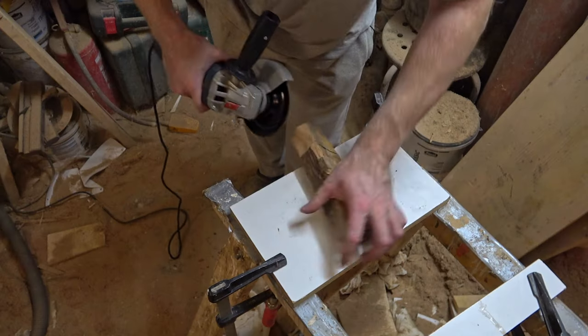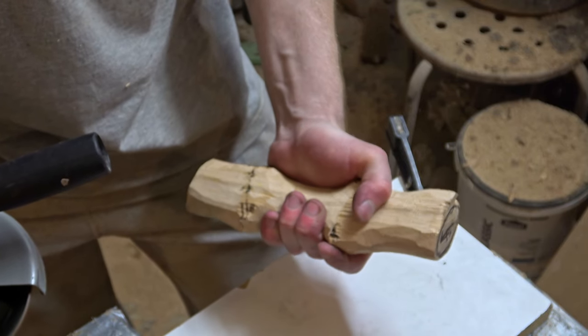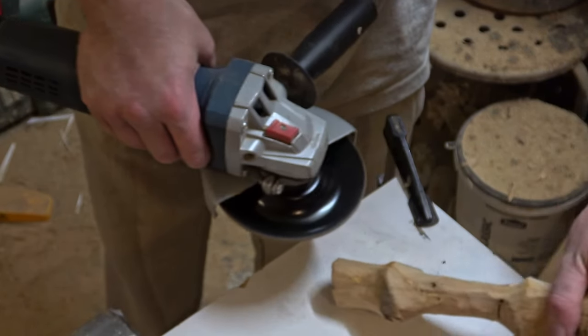At first I thought, yeah, well, okay, let's take a steel bar. But steel on wood is always quite bad, because it just rips through it instantly, even if it's oak. That's why I'm gonna go with wooden dowels and try to cover it up as good as possible. Let's finish the grip then. That also sounds like a job for the edge grinder again.